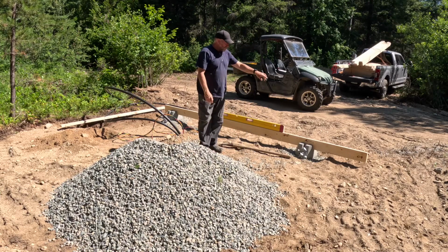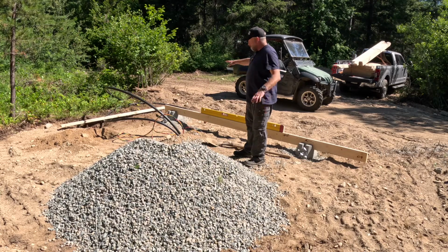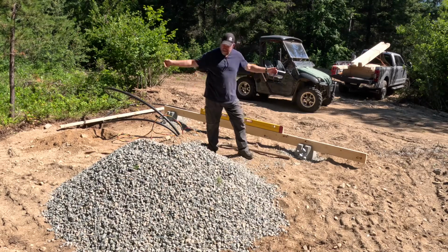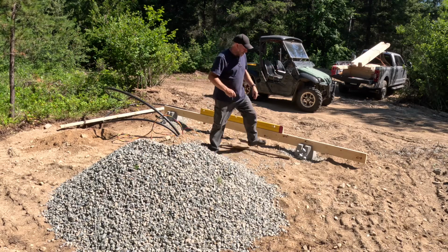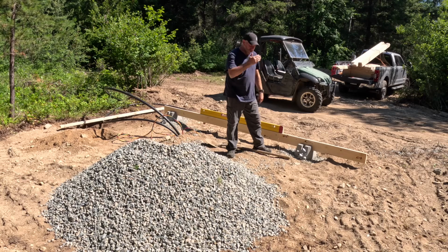So what I'm doing here is I'm getting 6 blocks level, floor joists with 5/8 plywood. Now I'm making these 2x6s on these platforms smaller than the actual building. It's going to be overhang, and there's a reason for that. So when I put my skirting around, I don't have to cut around this, just right around the perimeter, square, down to the ground. We're going to put some metal flashing on top of it, and we're going to backfill to it, because in the winter, I don't want any breeze in here.